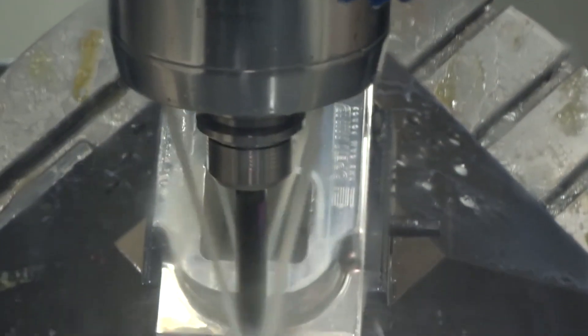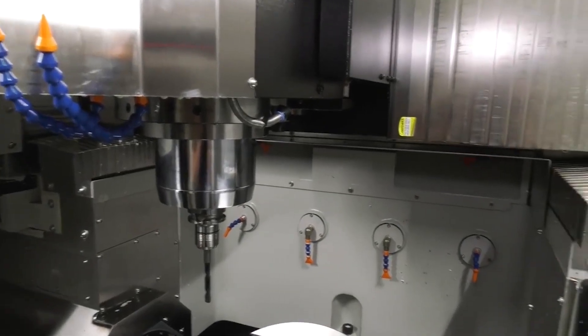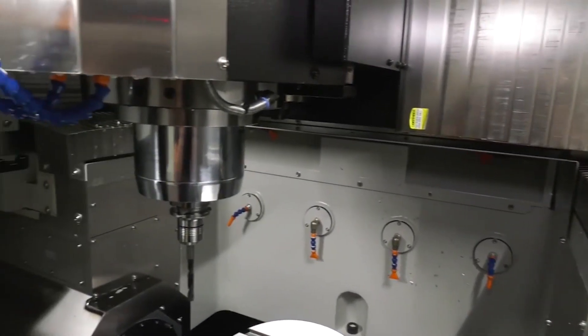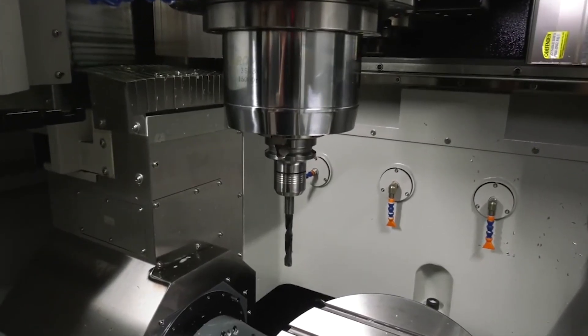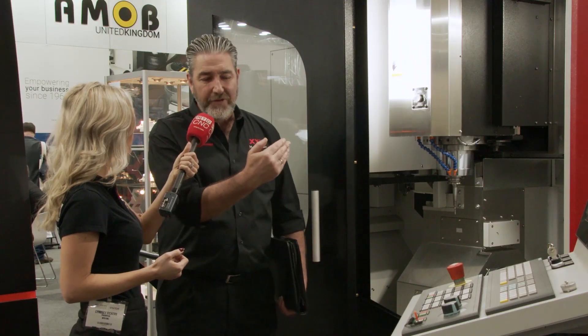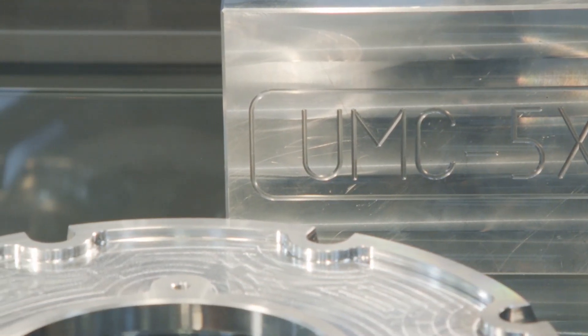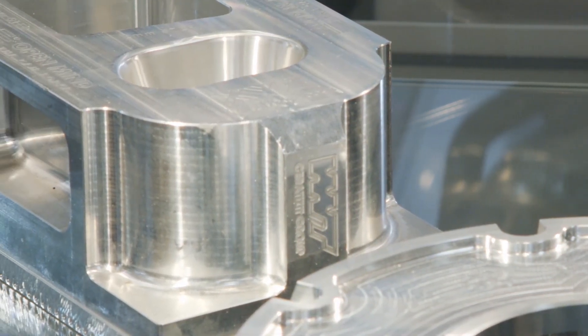For the C-axis you've got a torque motor direct drive, which gives rise to higher rotational speeds and better long-term performance. And this bridge-type gantry construction offers a number of benefits, predominantly to do with rigidity. Other machines tend to have the Y-axis on a ram protruding from the machine, which can cause variations in performance depending on where you are in Y. With the gantry, you always have a fixed distance between the spindle and the bearing support, giving consistent machining across the whole machining area.